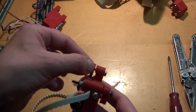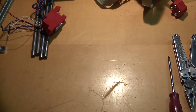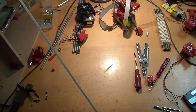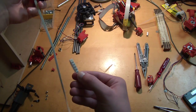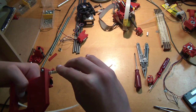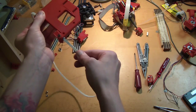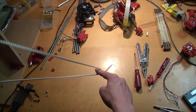You don't want it to be fixed in place. Now comes a little bit of a complicated part. So take your belt and make sure that your belt is not entangled. Then you take the other side and you rotate it 180 degrees. Then you turn it around your lower side like this into the nut trap, into this holder. The belt comes from here with the tooth down, so you wrap it around your motor pulley like this.